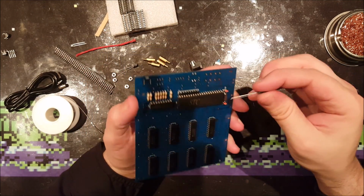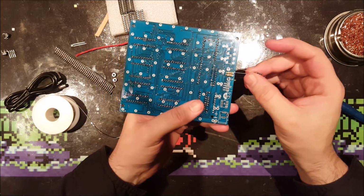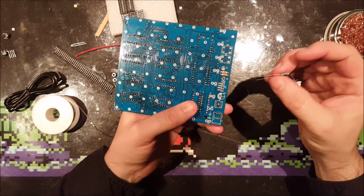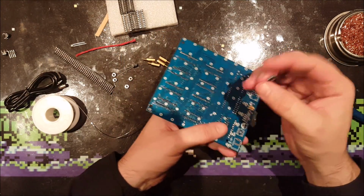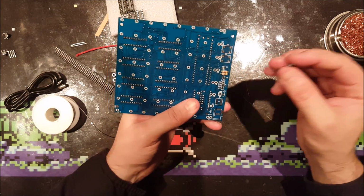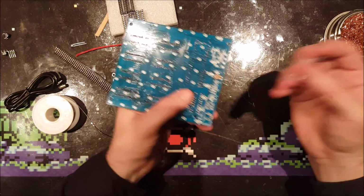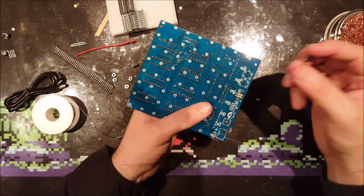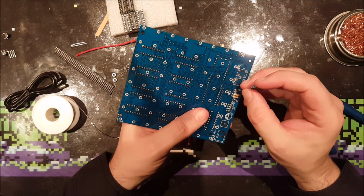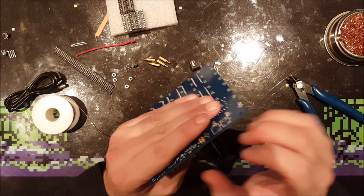So electrolytic capacitors go on the other side. Well, there's actually a small capacitor 1 and a large capacitor 4 marking on this, but I checked, both are the same, both are 10 microfarads, so I don't know why the other one is bigger. Probably when they designed it, it was designed for a bigger capacitor, but they found 10 microfarads is just good enough. I don't know what that's about, but since I only got those two, I'm going to put those two in here.